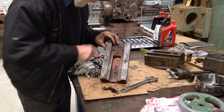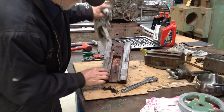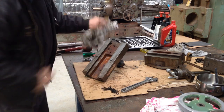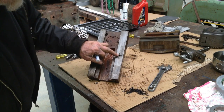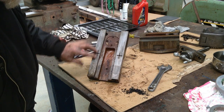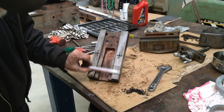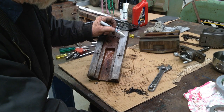Okay, now, there is oil grooves there, although minimalistic. I'll bring you down, I'll show you something. So they've got those two crosses for oil ways, so with the cross ones, the oil can go the full width, but putting oil grooves in like that in line with the axis, okay, they'll get away with it here as far as I understand, because it's only a short groove. You don't really want to continue them down this way any further, because from here back the compound overhangs the base.